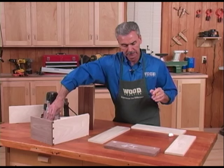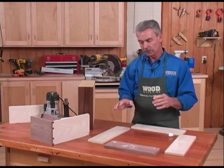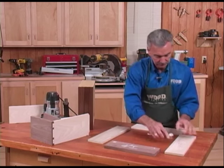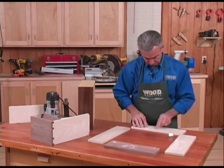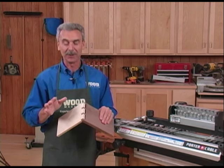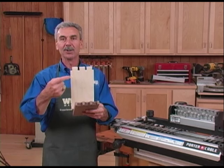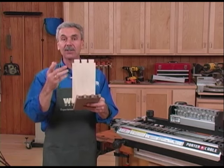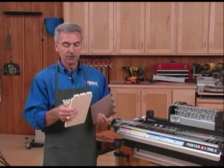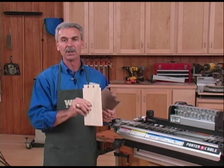One last little tip: as long as we've got the boards laid out for our sides and front, I think it's always a good idea to mark where the rabbets are going to go for that drawer box base — it makes layout a little bit easier when the time comes. The first joint we're going to do is the through dovetail, where you can see the joinery from both the front and the side. The tail board has the little tails that look like a dovetail, hence the name. To do this joint, we're going to do the tail board first, putting the outside edge in towards the jig.